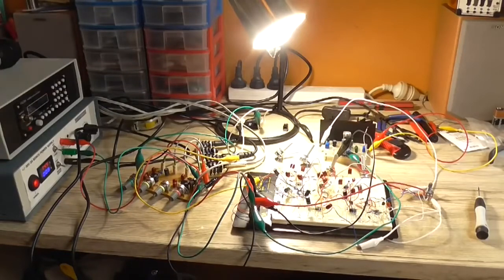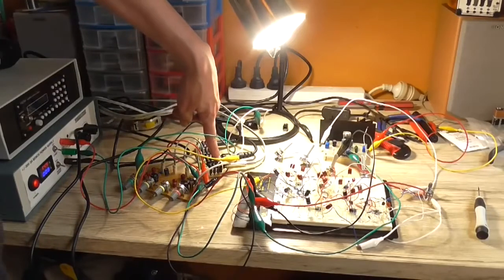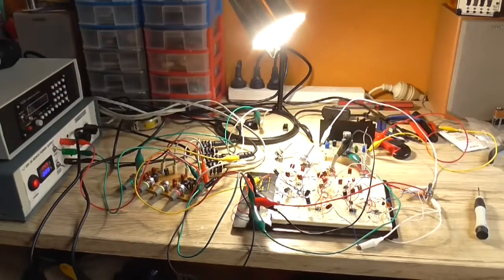Okay, I better not play any more of that because that is copyright. I had my grounding wrong because these are only mono connectors, so they don't go all the way to the end of the shank here, so you won't get a ground. That would be why. And also this input connector was connected crooked. I got a stutter now. Wahey!